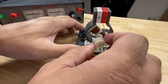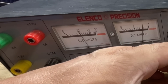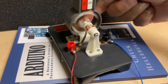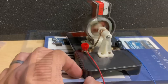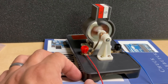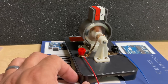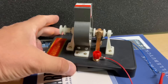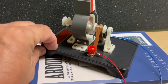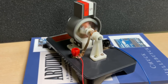I hooked it up to the power supply like before, but I could not get it to work. I cranked up the voltage but realized the power supply couldn't really handle it — it wouldn't go much beyond 10 volts. So I switched to a different power supply that could go higher voltage and higher current, and look at this — it spun! The 3D prints aren't as strong a magnet so it needed more voltage, but it started spinning and was pulling at 13.5 to 13.8 volts, running smoothly. I could move it around and it wouldn't stall — these 3D printed brackets were working beautifully. In fact it seemed to be running a little smoother than with the metal plates.